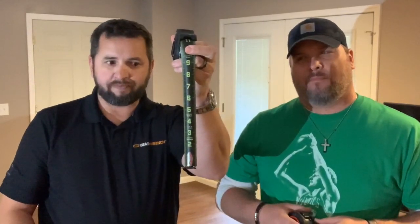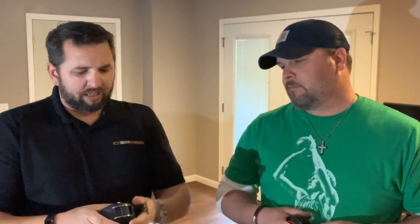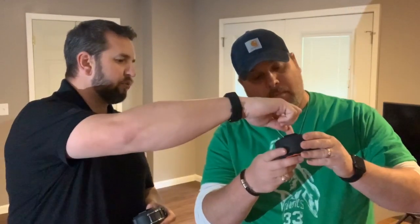You do have the horizontal and vertical measurements on the tape. One of the cool things — what's the block? Should be three and a quarter. One of the complaints about the Black Widow was it wasn't an even amount. So on the Shock Force, they've actually made this a three-inch block. So if you have to measure something and you get to a corner, just add three inches — exactly three inches.